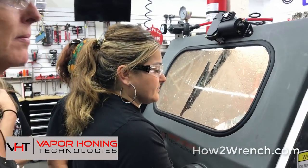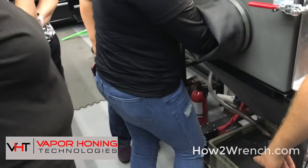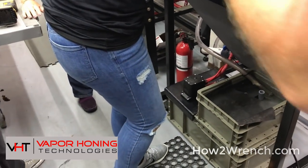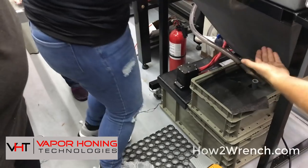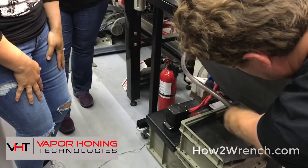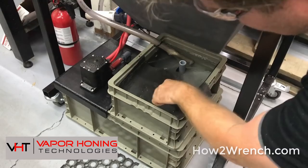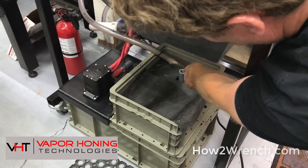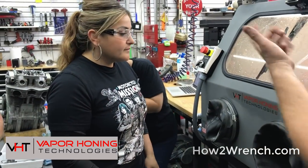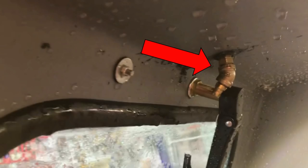There's something special about this machine too. It can be purchased by anyone — but look at the tank under here. For do-it-yourselfers like myself who didn't have a water supply, this keeps the water at the proper level so the machine works at its maximum. It runs off the edge into this tank, fills up, leaving all the debris behind so you can clean it. Then the water runs down, gets pumped back up, keeps recycling. That water feeds the parts cleaner and also the spray bar in here.